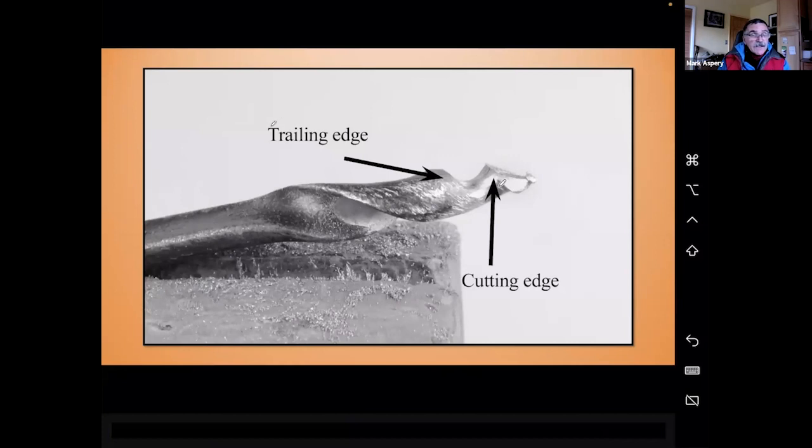Actually, would you believe that's terminology that comes from ploughing a field. The land side or the land cut comes from a plough, just information. And then we've got this trailing edge. This trailing edge, we're going to come in here and remove so it gets out of the way. And you can see I've just gone around this at my angle. You can see my thread is quite coarse, but that's going to do the job just fine.